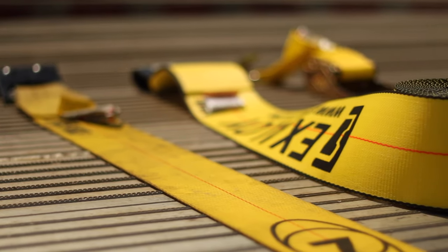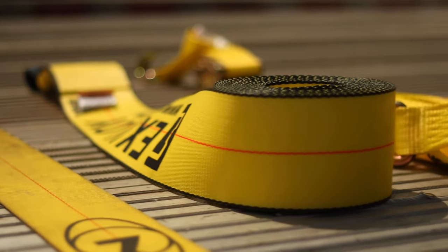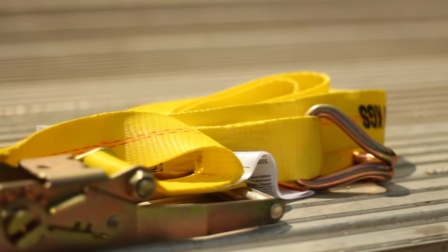Never use a strap in place of a chain unless otherwise directed by Fraley and Schilling safety personnel. It is against federal regulation for chains to form an X pattern in the eye of a coil. All chains must go straight through the eye of the coil in this style of securement.